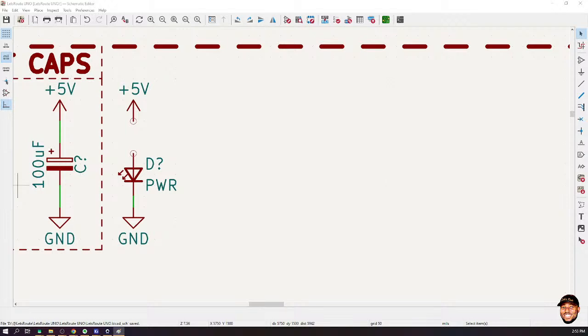Ohm's law is simply this. It says that whenever current flows through any conductor, there is a reaction that leads to generation of voltage across that conductor. That voltage is directly proportional to the resistance of that conductor and the current flowing through it. So we can mathematically express it: the voltage drop across the resistor is equal to the current flowing through it times the resistance. Take note, voltage always drops across something.